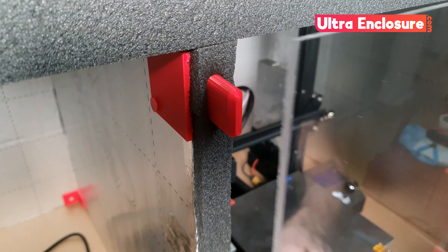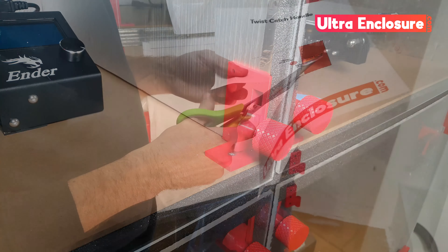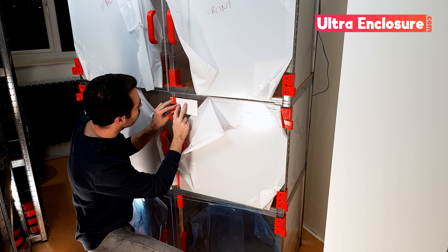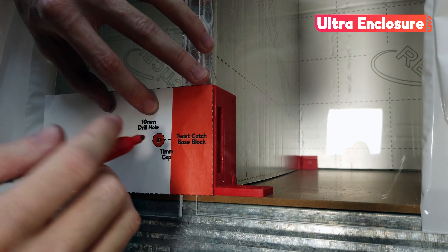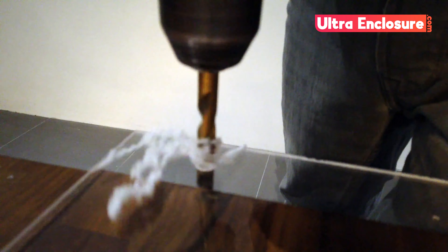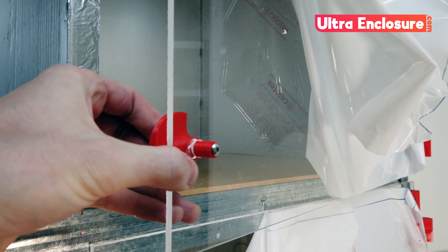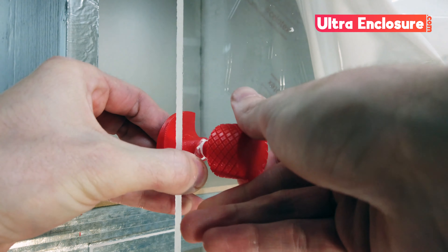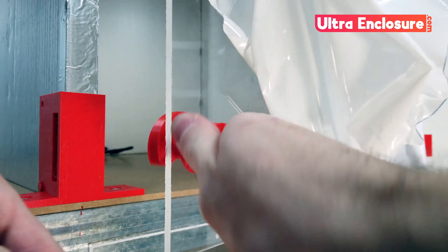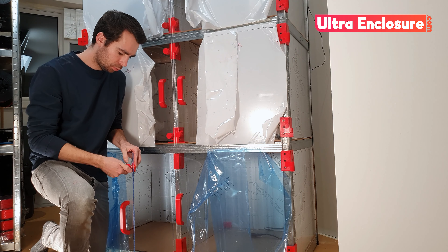If you've gone with spring catches your doors are now done — they should open with ease and latch closed nicely. I'm using twist catches so I have one further step. I've printed out the twist catch template and cut along the dotted line. I can now line it up with the catch and mark my exact drill point — I'll mark both the top and the bottom. Just like before I can now remove the door and this time I'll be using a 10 millimetre drill bit to carefully drill the two holes. We can add the two halves of the screw catch making sure the handle is on the front. Get it nice and tight but still possible to twist. If you find it does unscrew itself during use you can also use a dab of glue inside the thread. And with the door back on everything looks and works great. Repeat the steps five more times and the catches are all now in place.